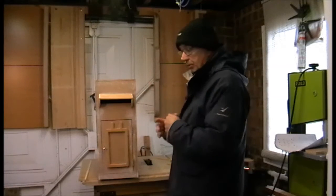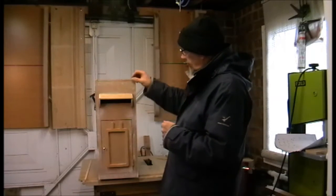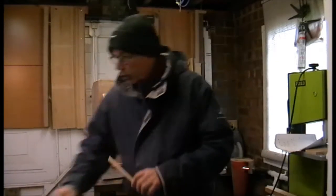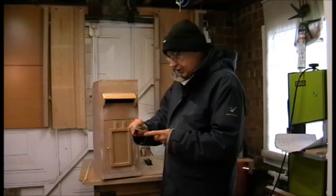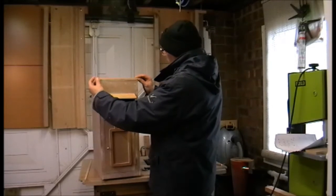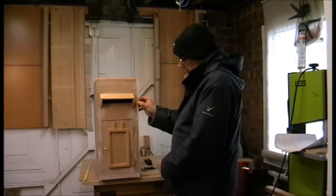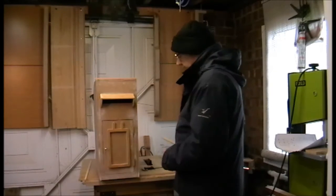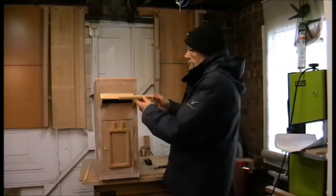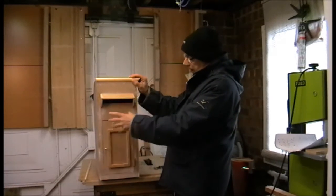The original postboxes are made out of cast metal — they made the front and back separately and then joined together, and they have a big step around the side. The way I deal with that is using some wood, cut on the table saw, roughly 9mm by 6mm or 7mm. I've mitered the corners, fastened a piece on the top, then another piece down each side to give that step. Then I use some half-round beading, roughly 21mm, which goes on the front, hides the joins, and when it's all mitered, it gives the right effect.